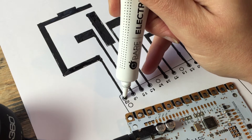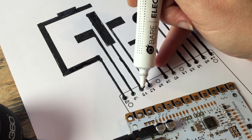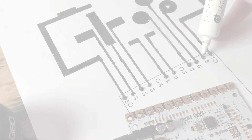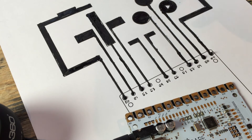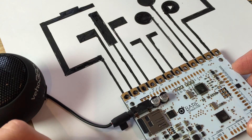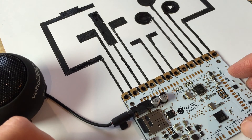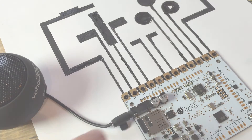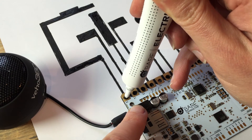Step 4: Attach the touch board to paper. Once your graphic is dry, squeeze a small droplet of paint onto each of the circles at the bottom of your template. Make sure the droplets aren't too large, as any paint bridging between the electrodes will cause a short circuit. Carefully center the touch board over your grid and place it down so that each electrode makes contact with the droplet below. Squeeze a second set of droplets on top of your electrodes — you don't need to cover them, only to connect to the paint beneath.